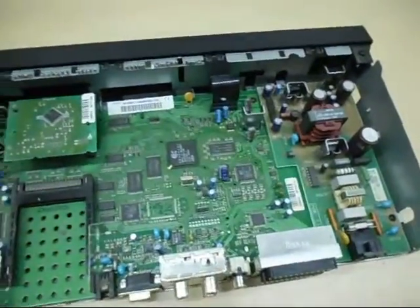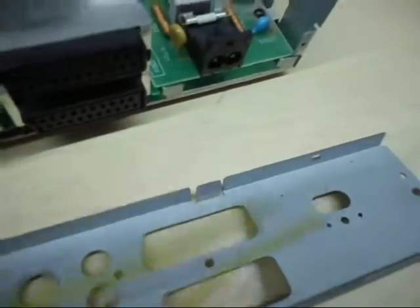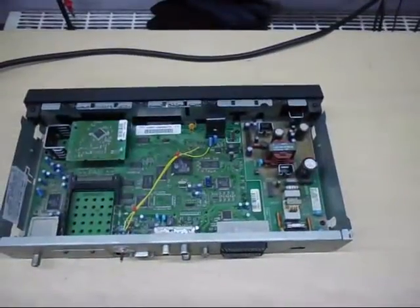Here's the sky box with the back panel removed. I've already drilled a hole in the back and inserted a little miniature switch. I've labelled it up 'sky' or 'bars' and two wires which we're going to attach down here. One we're going to attach to this little capacitor here, which is actually pin 48 of the IC - a 3.3 volt supply - and the other we're going to attach to the top of this resistor here, which is actually pin 25 of the IC.